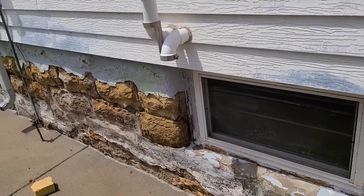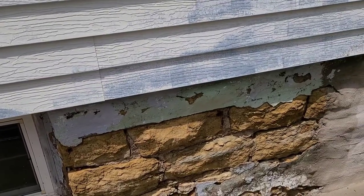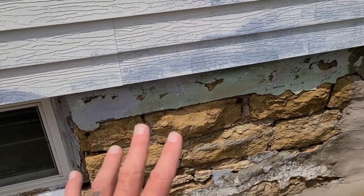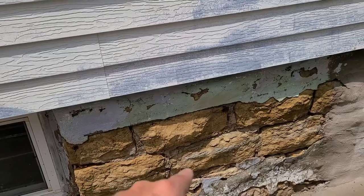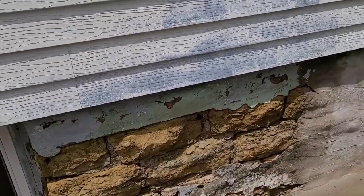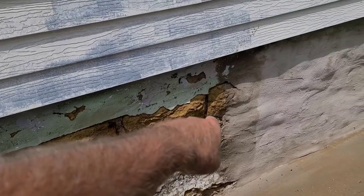Here's the way I do this. First thing I'll do is mix up some pure portland cement - just portland, no sand, no masonry mortar or anything - and make it like a soupy consistency, a little bit soupier than pancake batter, and I'll paint that on there to create a glue-like bonding agent. That's what I did over here already. Then I'll mix up some mortar, a little bit thicker at first, and fill in the gaps kind of like tuck pointing.